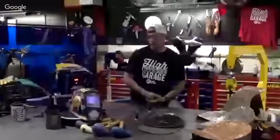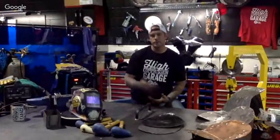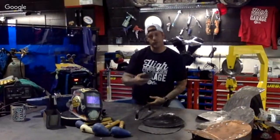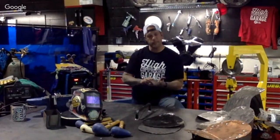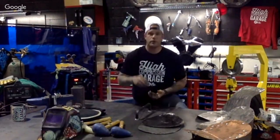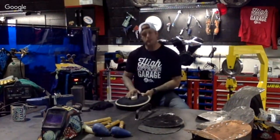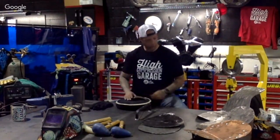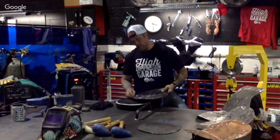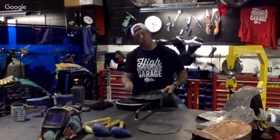So if you want a list of tools or equipment to get, it's again the teardrop mallets. It's going to be the sandbag or shop bag. Different vendors call it different things. Hammer and dollies. These are the dollies where we can beat against them and get a different radius. There are also shrinking hammers, which you use if you're putting this dolly on top of your shop bag like this and pulling your corner over. I don't have one in sight here, but the hammer has a pretty much circular area on the inside, which will shrink the metal as well.